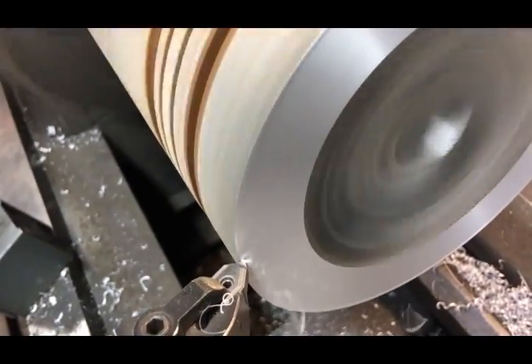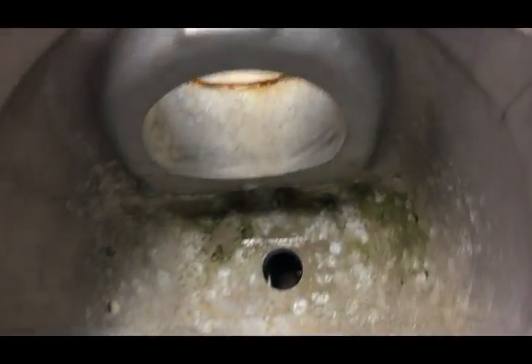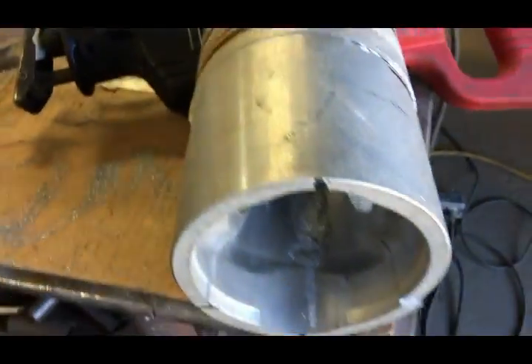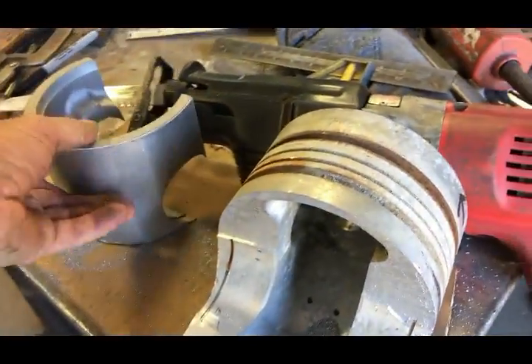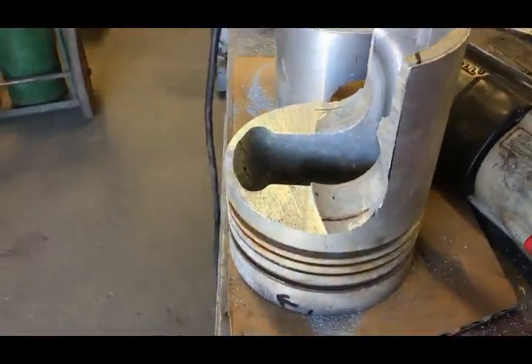You can see by my insert that I grind it and get as much use as I can out of them. Here I got them sitting side by side just making sure the holes line up with the T-slots. The two tools I used to get rid of the bulk of the material were the zip wheel on the grinder and then finishing off with the sawzall. That was the point where I decided I'm going to call them booster chairs.